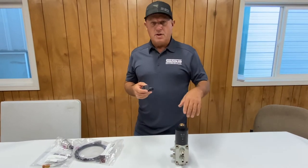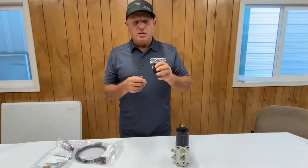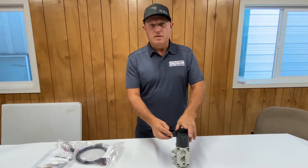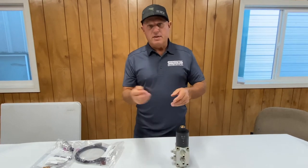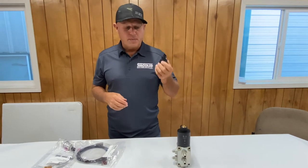This one is generally off the cement mixer and what you're going to see is this little DIN connector. Usually they don't even put wires in this, so you just have this sticking on the side of the solenoid. There's a little screw inside here — you just want to take that off and open it up and you'll see how all the connections are made.